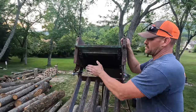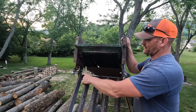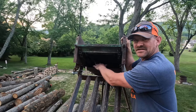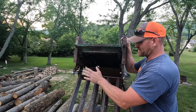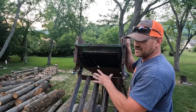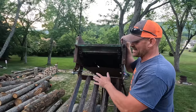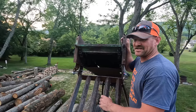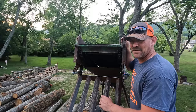So before, with the grizzly bars way out to the edge here, when the wood would fall off, it would hit this, and then these paddles would drag the pieces down inside here. So now that it's back farther, the wood actually falls and hits here and then goes into the trailer. Like I said, I might actually move them back 2 more inches, then I'll be really good. But right now, I split half a trailer load of wood here and it hasn't jammed up on me since. All right, let's get back down here and split some of this small wood and make it even smaller wood.